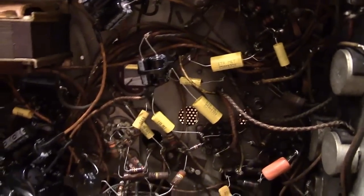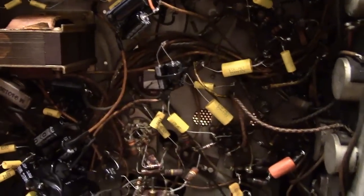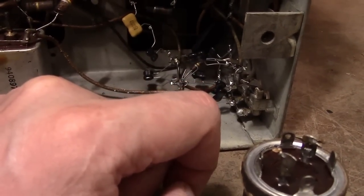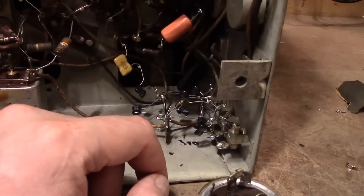Lots of guys have done it. Electrically very sound, but I'd like to restuff these if possible, for no other reason than when I compare the sets, I can match up the wiring. He also went so far as to replace some of the mica caps, which is not a bad idea. When I did my RCA 630 TS, which is similar design and vintage, I ended up replacing pretty much all the mica caps because they'd gone bad.